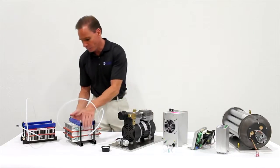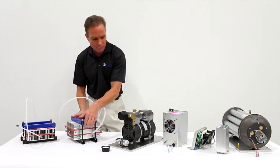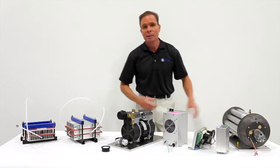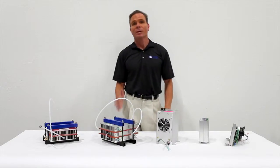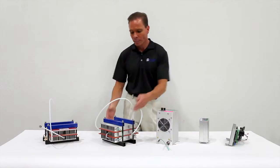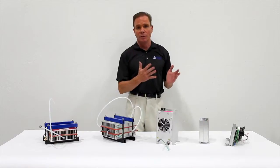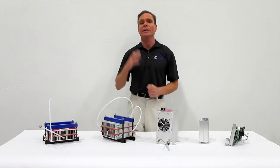What I'd really like to emphasize with this display is how modular our components are. Simply with four screws and literally a wrench, we can remove the reactor cell. The same basic tools are required for removing the compressor module and even the oxygen concentrator module, so maintenance is very easy to do. These items are designed for very long life, but should one fail, you would simply pull it out, install your spare unit, and the failed unit would be sent back to Pacific Ozone for refurbishment.